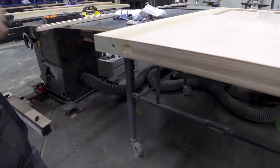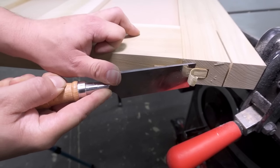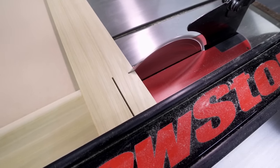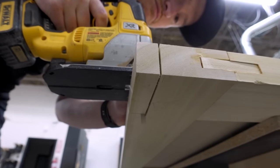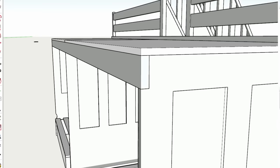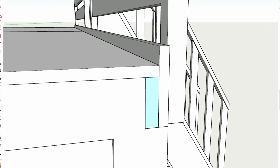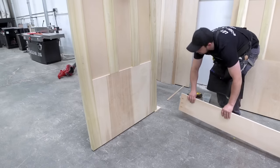Switching back to the support panels, I drill holes in the bottom for adjustable feet, then trim away the exposed tenons at the top to cut notches. These notches accommodate the supportive rails that function as the upper bed frame. On one side the notch is 1-3/4 inches wide and on the other it's only 1 inch wide — because the back side frame toward the wall needs a 1-inch wide board as the actual bed support, while the front side needs that same 1-inch support plus a 3-quarter fascia that hides the plywood. So the front notch needs to be deeper to accept two boards.